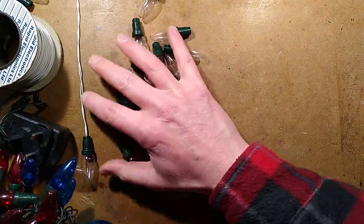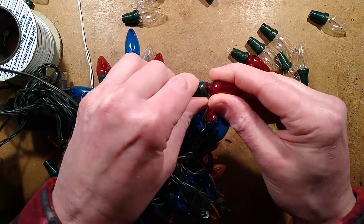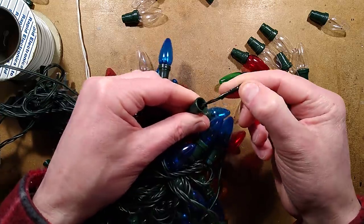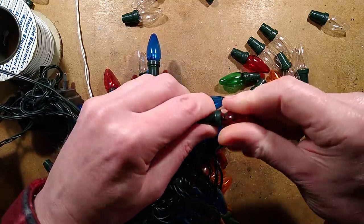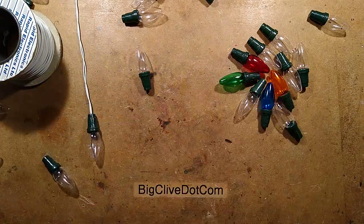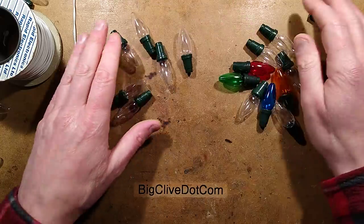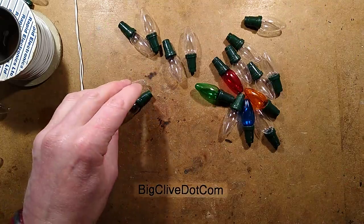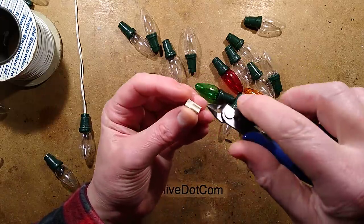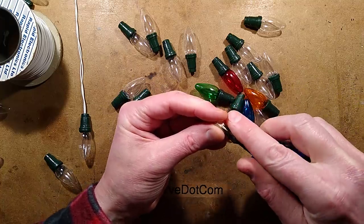These holders are based on a string of lights I got a while back. The nice thing is that you can actually pop the cover off - they're constructed with the standard sort of LED and heat shrink arrangement. You can actually retrofit these. I found out that I could put these little Molex type connectors in. There is one slight thing you have to do: you have to cut off the little alignment tangs to actually get them to fit in.